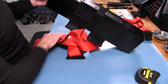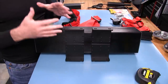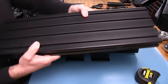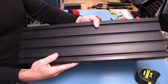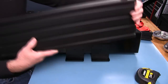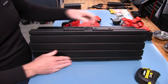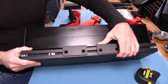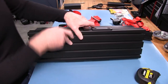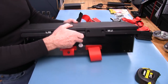The brackets on the back are currently set up for a 40-160 profile, which you'll find on heavy-duty cockpits. The 40-160 is essentially four 40-series pieces combined into one. The unit slides right into the bracket spacing, and the holes line up perfectly. We have countersunk holes for flathead M6 bolts, giving a flush, secure mount to the profile.